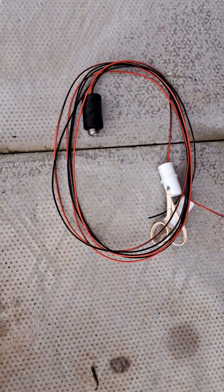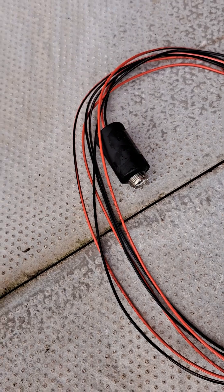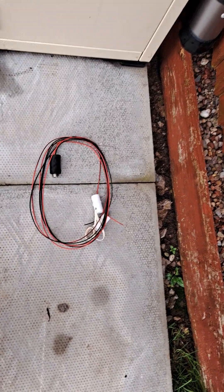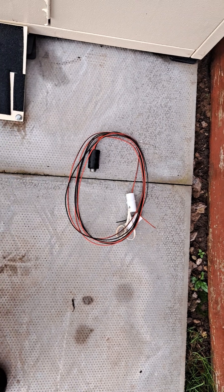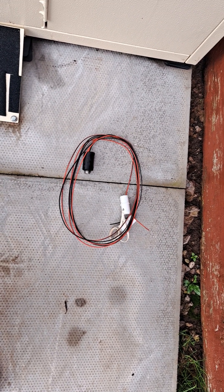And that's how the antenna looks when it's taken down. Basically it's an SO-239 connector, so you need a bit of coax, and just two insulators — that's it. You can string it up vertical or horizontal and it will give you HF. As you heard, it's receiving no problem on 10 meters, 28 megahertz.